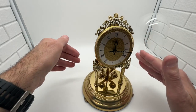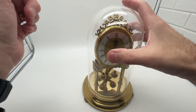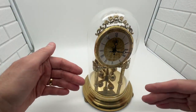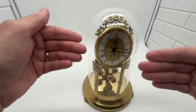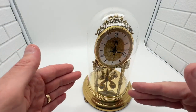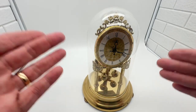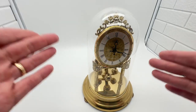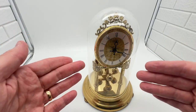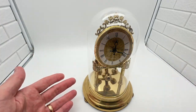It's pretty much ready to go — that's how you set up the clock. It'll go back and forth; put the dome on. It'll settle down within about 15 minutes and just start keeping perfect time back and forth. The pivot is now in a nice cycle, going back and forth. Once the hands are set, battery's installed, and everything's adjusted, you're good to go. That's how you set up this specific anniversary clock. Hope this video was helpful — it's a beautiful clock and it works fantastic. Thanks for watching.